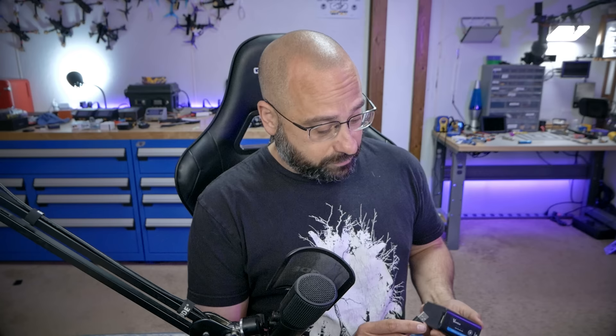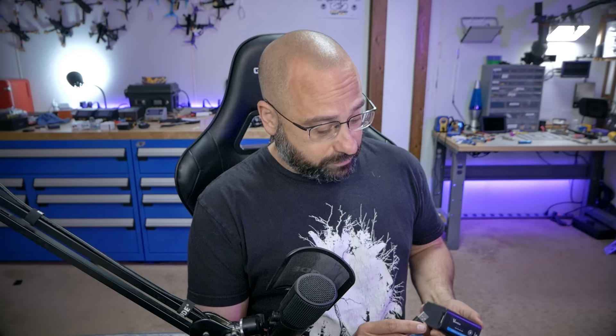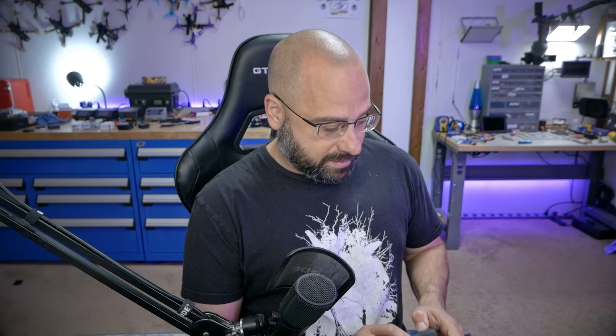At this point you could go fly, but there's another really important piece of setup: the on-screen display. The DJI O3 has the ability to talk to the flight controller, read information from it, and display it in the goggles — like a fuel gauge for your drone. In order to set that up, I'm going to need to leave this air unit running for a bit, and since I don't want it to overheat, I'm just going to plug in this little USB fan. Let's plug USB into the flight controller — not the O3, the flight controller.